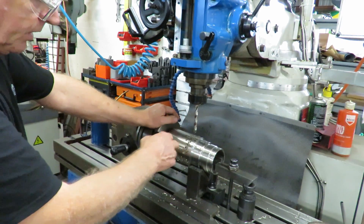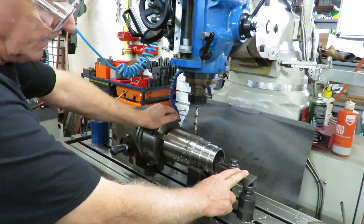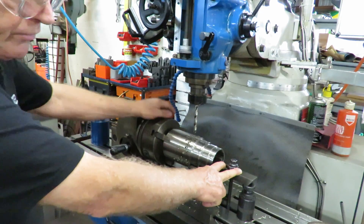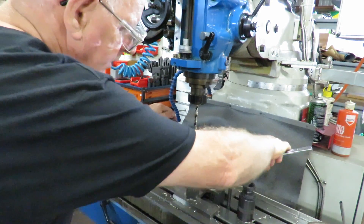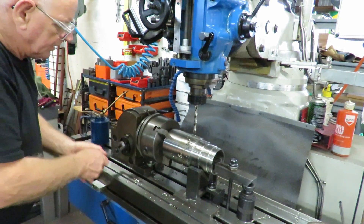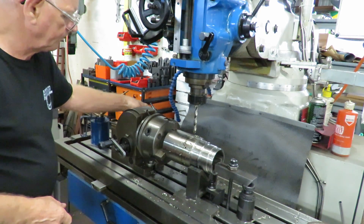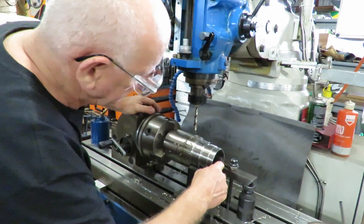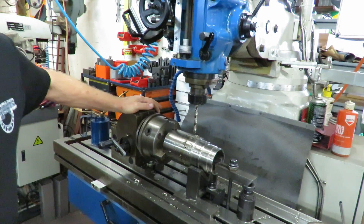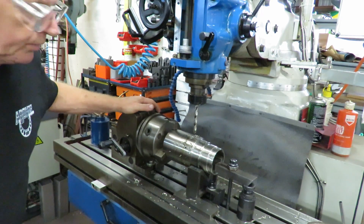I'm drilling the holes — I've done the pilots, I'm going through drilling all the holes as I rotate 60 degrees each time. Because I've got it nice and shiny and oiled, it doesn't even slip. When I turn it — I'll just do the one to show — I release off and take it around to 300 degrees. Then it's all in place, nothing's moved, and all I've got to do is tension it up again and I'm ready for the next drilling. So that's it for this part and we'll continue on and show some more as we go. Thank you for watching.